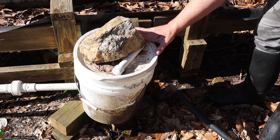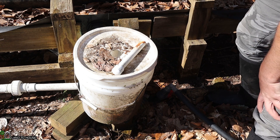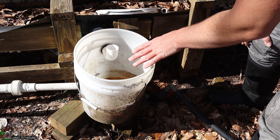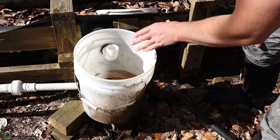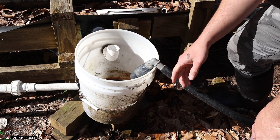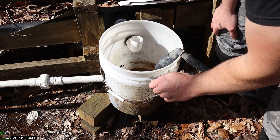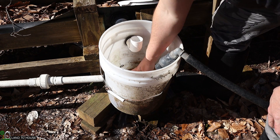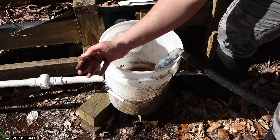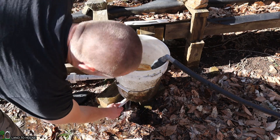This is called a silt filter bucket. It's not necessary for the operation of the ram pump, but it does make things a lot easier. If you have a way to capture the silt and also have an air-free water source, it's going to help significantly. I place the pipe into the bucket to churn up and pull out the fine silt left over the winter. I use a short piece of PVC pipe with a cap to plug up the hole at the bottom.